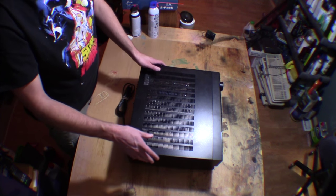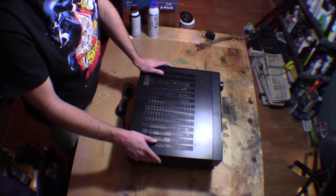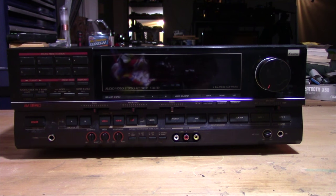Let's take a close-up look at this receiver and I'll talk about why I got it. I picked this Sansui up on eBay for $50 because the seller said the stereo receiver didn't have any sound. They said it came out of DC protection but had no sound. That in itself is kind of a dubious statement, because there can be several relays in a stereo receiver, and just because you hear a relay click doesn't mean it's the protection relay engaging the speakers. But for $50 it was well worth it. This receiver was built, according to Hi-Fi Engine, in '84 to '85, though I did see sales brochures for it as late as '86 or '87.